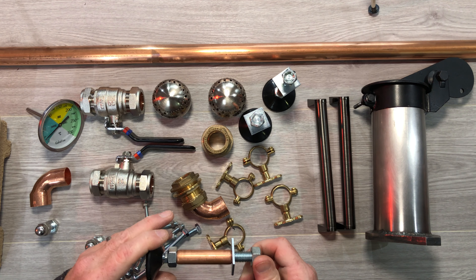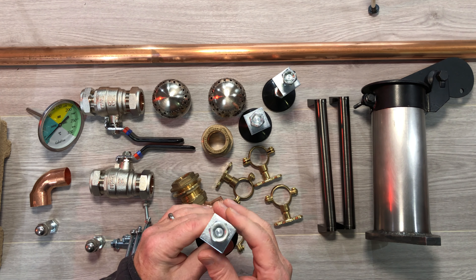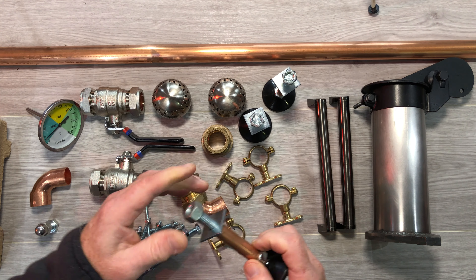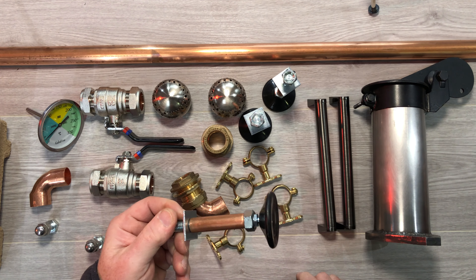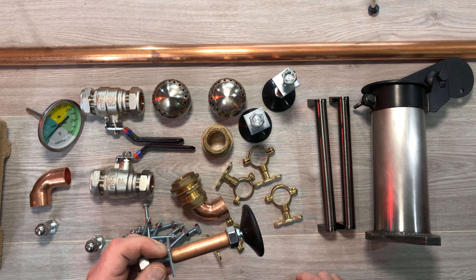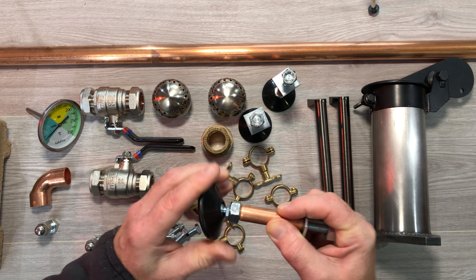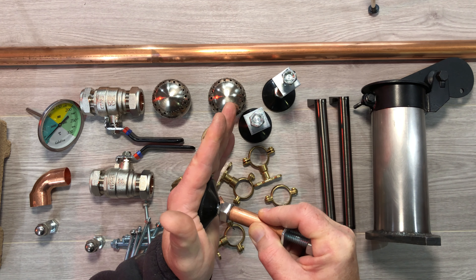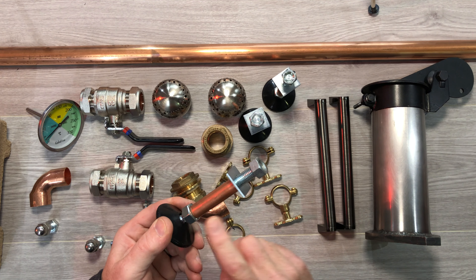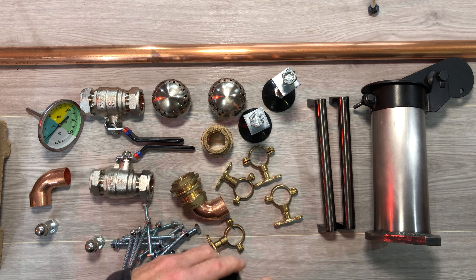These things were left over from another project. They're M12 bolts and nuts. These square washers I actually reamed out so they fitted on the thread absolutely tight. These are the legs for the drum — there's three of them, so it'll make a tripod. A tripod's better than four legs on uneven ground. What I like about these is they adjust, so however you put them on the ground it will take up the difference. It's just M12 thread all the way up, two nuts, a reamed-out washer, and that's 15mm copper pipe — I did that just for looks.